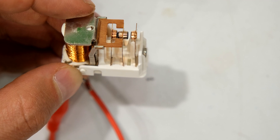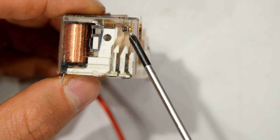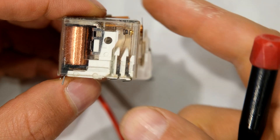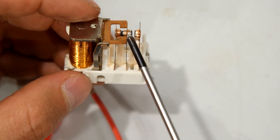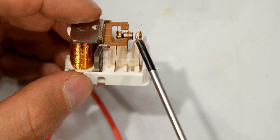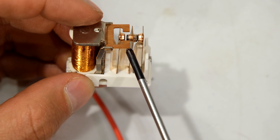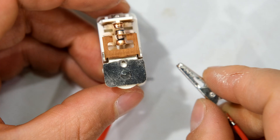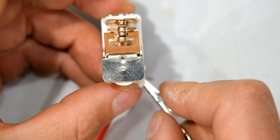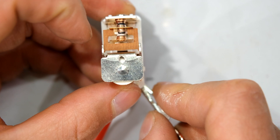Some relays only act as a switch. For example, if you look at this relay we can see there are only two contacts — one and two. It's an open circuit but when the relay activates it becomes a closed circuit between those two contacts. Now this relay has three sets of contacts. This one is already touching this one — that's what we call a normally closed contact — and over here these are the normally open contacts. When the relay activates it moves this contactor to the other side, so as I energize the relay you can see how that magnetic force pushes that leaf spring from one contact to the other.